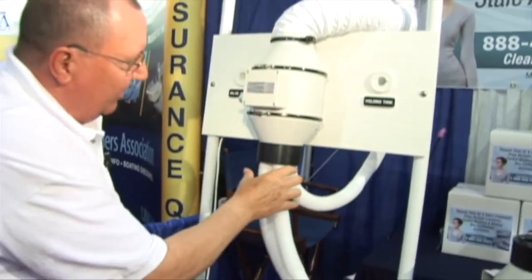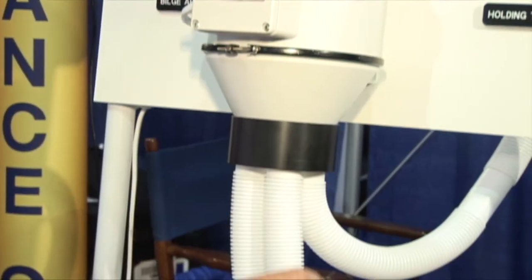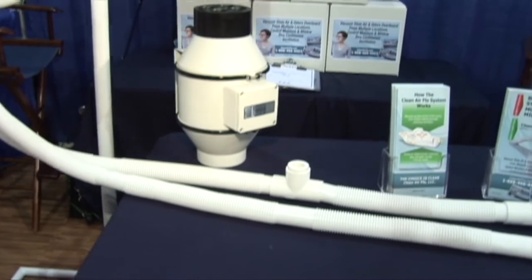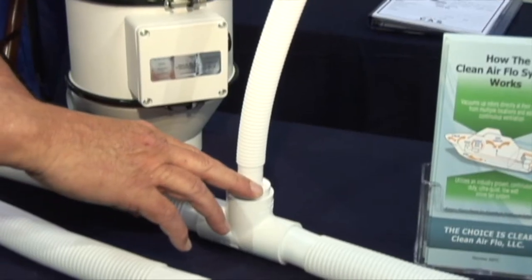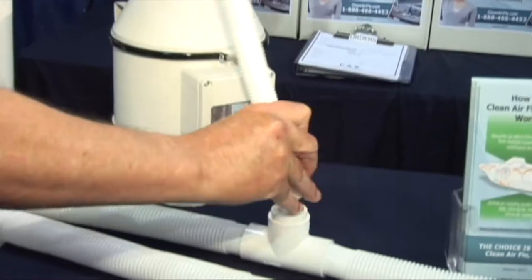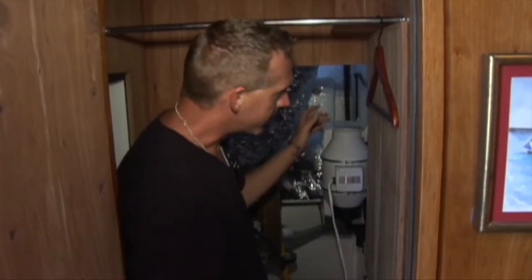You've got four inch-and-a-quarter ventilation hoses that you can connect to the system and run to four problem areas. You can also, as I've shown here, tee off from the inch-and-a-quarter hoses and put in a three-quarter inch hose to smaller areas such as the head or cabinet areas. I'm putting four systems on this 100-footer, and I have another 112-footer in build where I'll be putting another four in as well. Right now I have one in every watertight compartment — both boats are split into four sections.